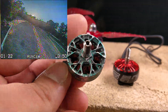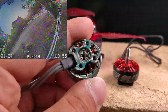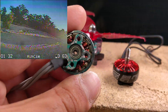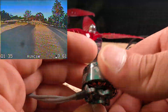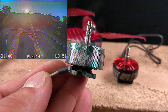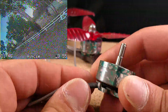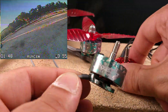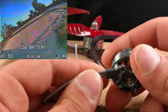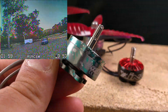It's a hollow shaft, hollow all the way to have a three millimeter socket on the screw head, which is really nice. You can see it's got that nine millimeter bearing in there — really nice bearing. The base of the bell has this little railing to hold the wire down, which is really nice because sometimes when you mount it to your frame it's pushing the wiring up and it can run into the bell and scratch against it. The wires are 20 gauge and they are gray, which I haven't seen on a motor, so it's nice to have that originality.